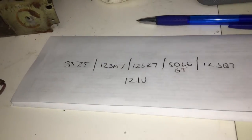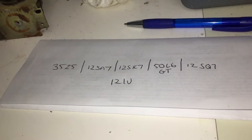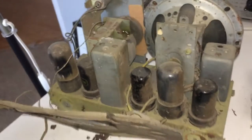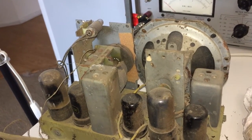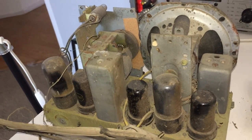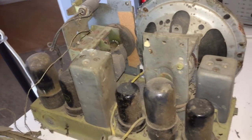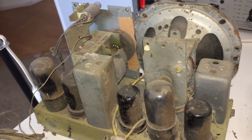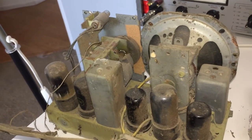Just wanted to point that out. I'm going to identify the tubes and pull up the schematics as well to make sure the tubes are in the right sockets. I have a pretty good feeling they are. These metal tubes are pretty resilient; the glass tubes, not so much, and they could be the original complement. I see there's some RCAs, some non-RCAs. We're going to do the best we can and see what we could do with this on the cheap.